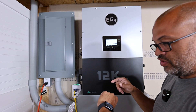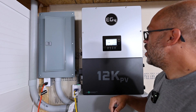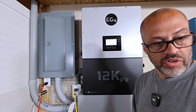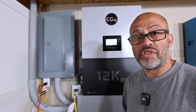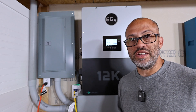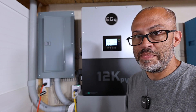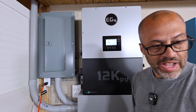It just kicked back on — it's 4:23, so after about a minute it restarted on its own. I can hear the vacuum kick on and the EV charger ramping back up. Now we're at 8,123 watts — the app shows 8,300 watts. So if it overloads while you're outside working, it's automatically going to restart on its own. You can just disconnect one of your extra loads and you're going to be fine. Disconnected the shop vac and the load is back down to 7,600 watts.